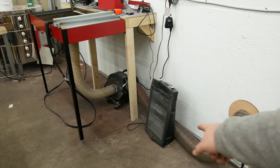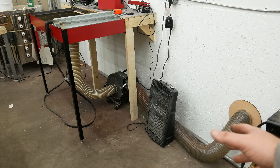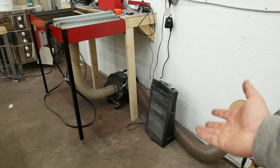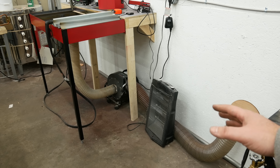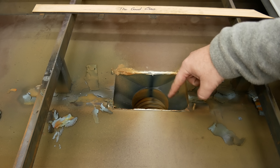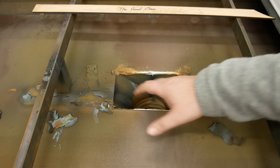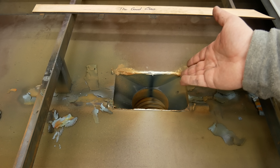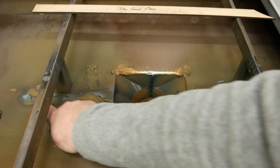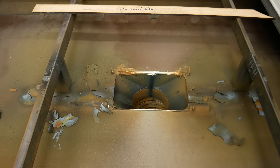That went better than expected. Now you might have noticed I'm using PVC plastic hoses for the fume extraction and extraction of little droplets of molten steel. I figured the force of the air blowing past it would be enough to cool down these droplets of molten slag so that the plastic hoses wouldn't sustain any damage — and that turned out to be true. But what I didn't expect was this plastic air fitting at the bottom of the table that I was shooting the plasma torch directly at was completely unharmed. I left it unshielded with any foil tape just to see what would happen. The steel right over where I was shooting the plasma torch got so hot that it scorched and warped, but this was totally unharmed — I guess because of all the air flowing past it.